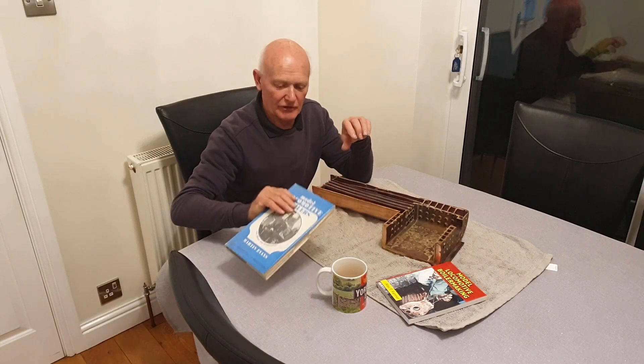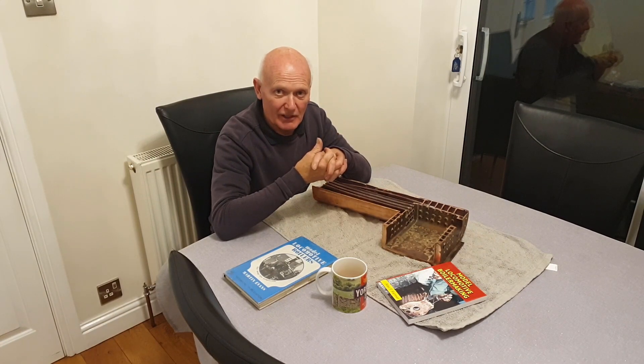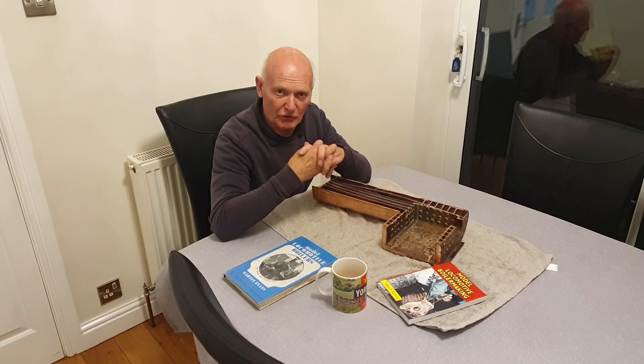If you go on YouTube, you could go to Blondie Hacks. Quinn on the Blondie Hacks website is building a three and a half inch gauge boiler for her switcher American locomotive - a very descriptive boiler build. She's using a two thousandths of an inch gap between the plates. She previously tried to build a boiler with one and a half thousandths of an inch gap and thinks that was a little too small, so she's now working on two thousandths of an inch. It's a very good video channel.